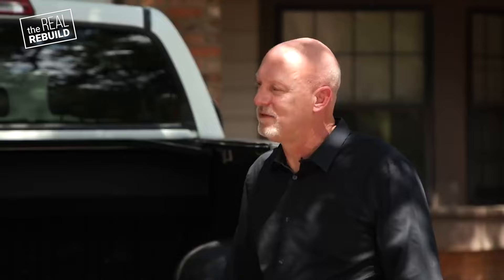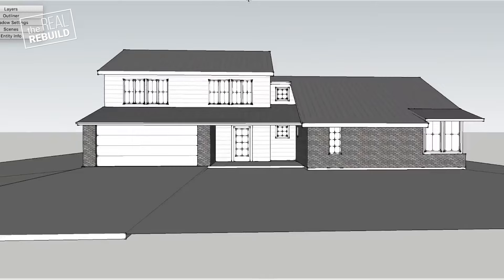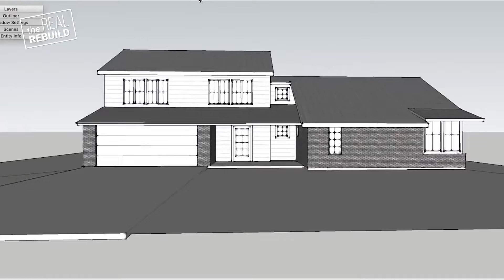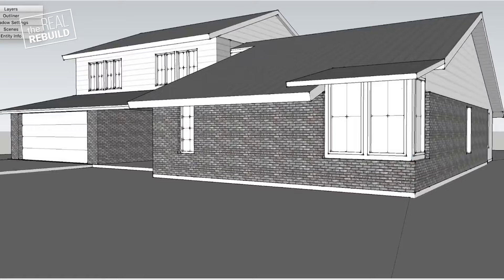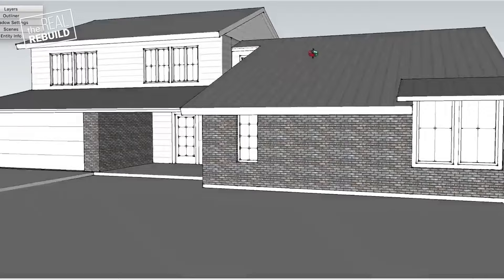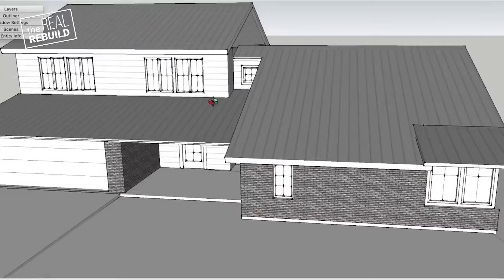That first pass had some good ideas, but working together we came up with a much better solution. We've kept a pitch on this lower roof but brought it down less. The original pitch is 5-in-12, so we brought that down to a 3-in-12 — still enough to shed water. By bringing this roof down, we were able to introduce some windows into the bedroom again and make the front facade more friendly to the neighborhood. And this was really your idea: you said, 'What about bringing that roof over?' So we brought it over, and that made a shallow porch for the entry — really working on this whole idea of a welcoming facade.